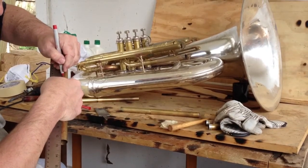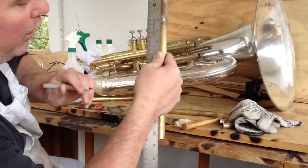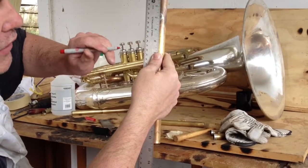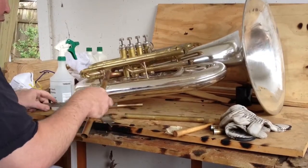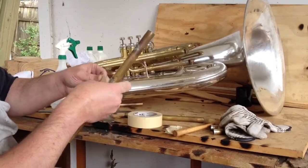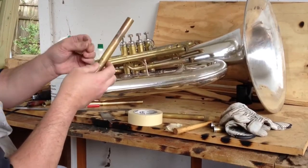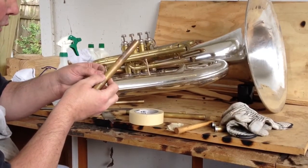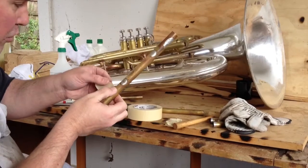I put the mark on the side I'm going to cut off, which is the lower half. If you look, the mark is just below the line. The tape I'm going to mark it with goes where the line is, at the top of the red ink. It has to be that precise or you end up with a gap of about half a millimeter to a millimeter, and that looks unsightly. Now I'm going to take my tape — you want the edge to be straight, you have to have a very good sense of parallel and perpendicular. Measure twice, cut once.